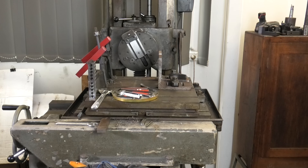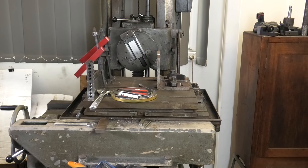Here's one of the reasons I like the Kearns borer so much — it's just so easy to clamp things onto that table, as long as you can fit it within the work envelope, and don't forget the head goes up about six or seven inches higher than that. It's a slow working machine but it just makes it so easy to clamp things. Doing these boiler tubes I've realised I need to make some much larger strap clamps. But all in all, sturdy and good for what I'm doing — though I wouldn't class it as an industrial machine.